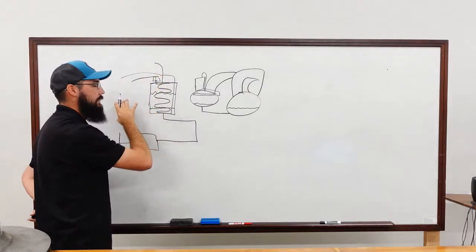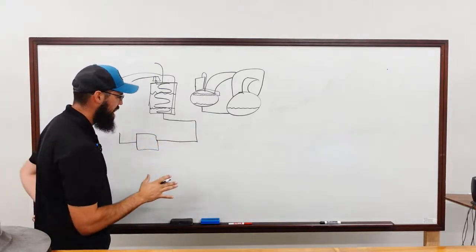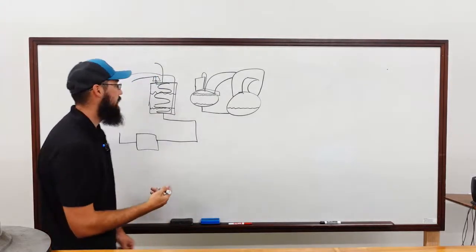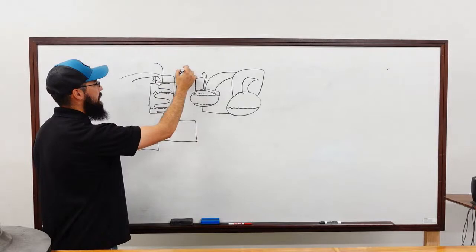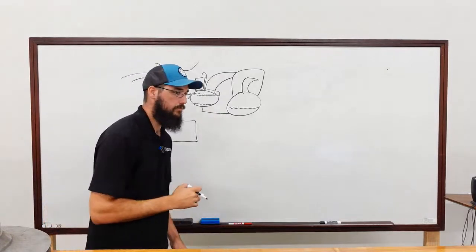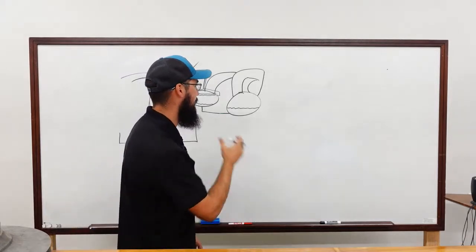When it sees the suction temperature plummet past a certain set point, for a Trane I think it's 18 degrees Fahrenheit, it registers that, hey, I have enough atmosphere in me to do a pump out. At that point, a little tiny pump sucks the atmosphere off the top of this chamber and vents it outside through the venting for the chiller. That way we can get rid of all that atmosphere. So that is an important part of a low pressure machine refrigerant circuit, and specifically Trane.